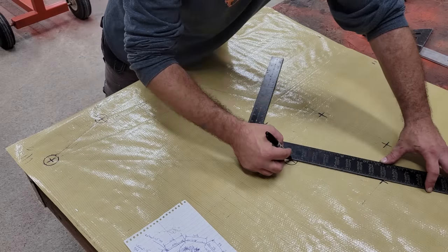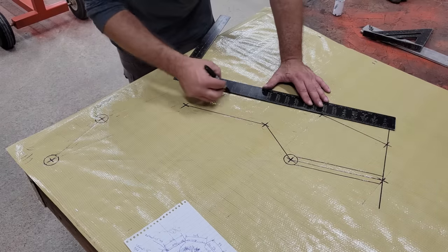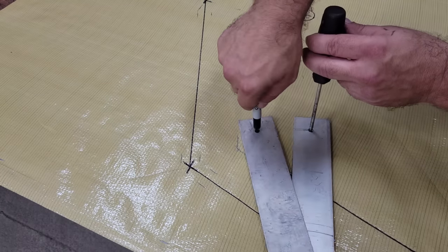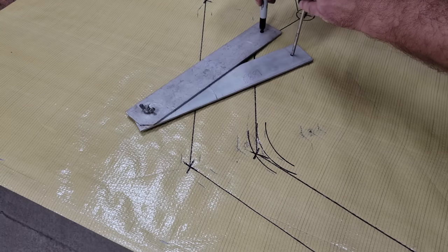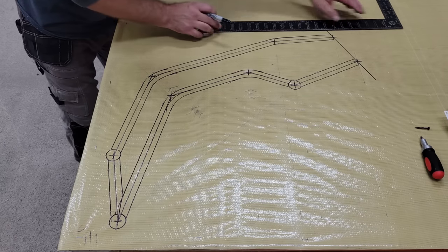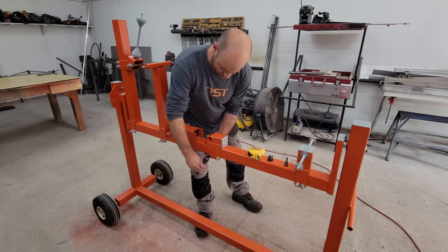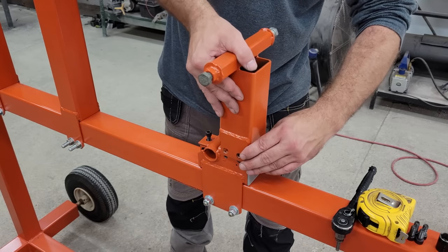To start building the new chassis, I laid out the profile on my workbench by drawing the center lines and bends for all the main tubes and the locations of things like the head tube and fixtures for the battery and swing arm, so that I could use it for reference when bending and cutting the tubes to size. Next I set up the fixtures for assembling the chassis components on my homemade rotating chassis jig, which will hold them securely in their proper locations as they're being welded together. I'll put a link for that build video in the description as well.